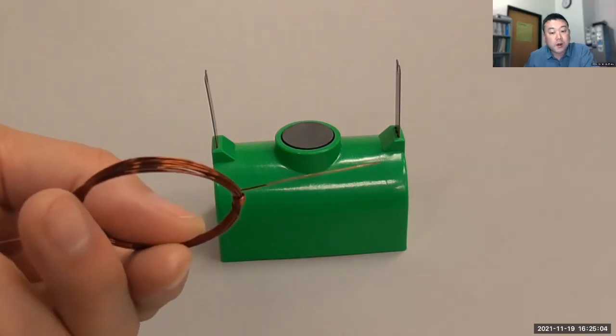If it's stripped off perfectly uniformly, then the motor shouldn't work technically, because basically the net torque over a whole rotation adds up to zero. Now, in experiment, it turns out not to really work out that way. Even if you strip it all the way around, it still works. I imagine because the electrical connection we make is such a poor connection that as the thing turns, there's enough asymmetry that it still works. But anyways, the instruction is to strip one side, and you want to figure out when the stripped side is in contact that there's a torque on the wire. So that's what I'm showing in the video, the stripped portions of the wire where electrical contact will be made.